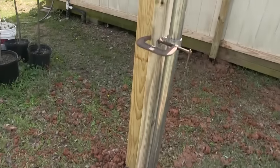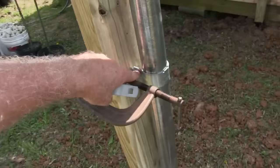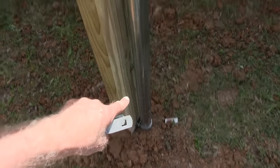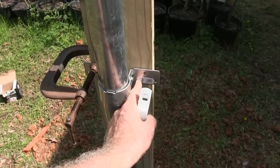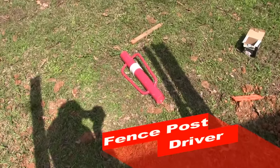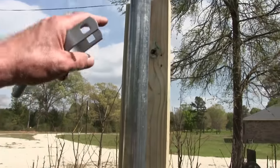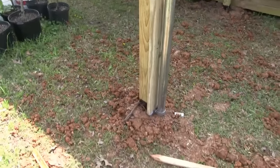I got my four by four here and put a two by six up against there. I picked up these post holders — you'll find them in the fencing section at the big box stores. I put one down there and one here. I'm going to customize them — cut these ends and drill another hole. I just C-clamped it temporarily to hold the post in place, and now I'm going to hammer it down to a height of about a foot into the ground.